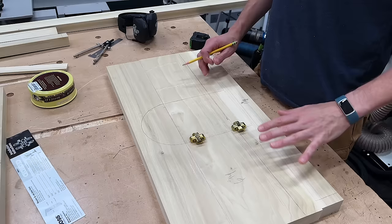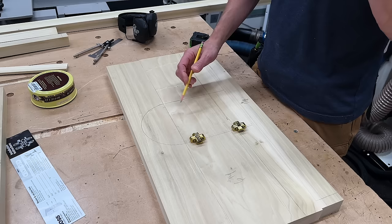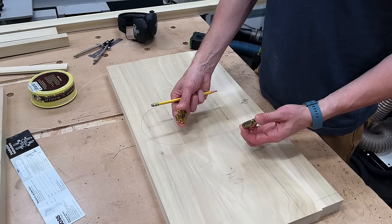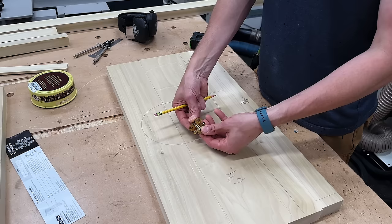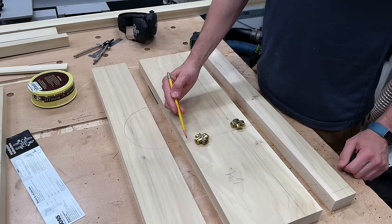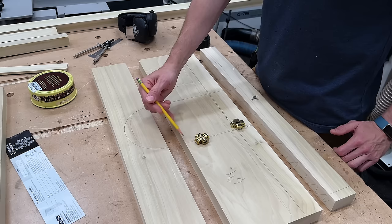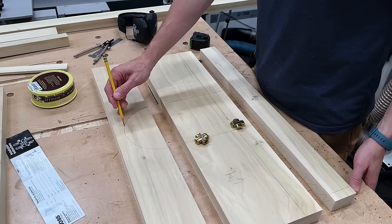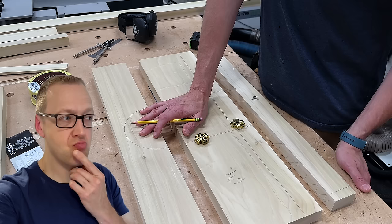The first order of business was the multiple pieces that would need to be glued up for the large bottom rail for the cat door. It's your classic chicken-and-egg story: I really want to glue this panel up as one and then cut out the door with the Shaper Origin, but then I realized I wouldn't be able to get my drill in to cut the recesses for the Soss hinges. So since I have it in three separate pieces, I'll cut this out, use the Shaper Origin for the hinge recesses, and then make a fresh door out of walnut.